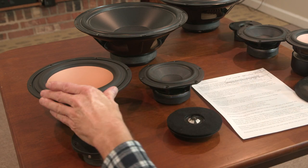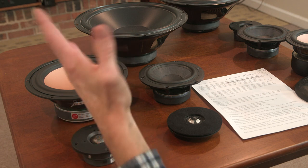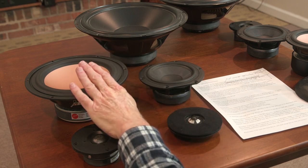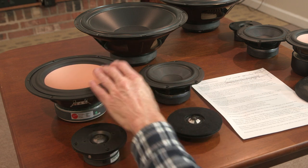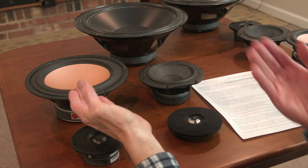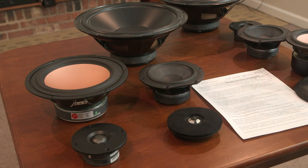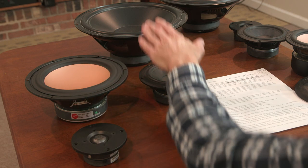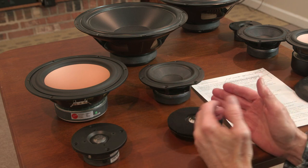Now, I have to say, listening to my 8-inch two-way system just about every day up in my office, I'm not sitting and hearing that Doppler distortion and complaining, oh, that Doppler distortion, it's so annoying. I'm not noticing the Doppler distortion. But if I put test tones in my 8-inch driver, a 1,000 cycle tone I mentioned, or 1,500, and then put a 40 cycle tone on top of that, I could probably hear that 1,000 cycle tone modulated on the 30 cycle wave, and you could probably detect that Doppler distortion easily. So the Doppler distortion is there whether your ears attend to it or not. And obviously you'll limit that. You don't eliminate Doppler distortion with any driver system, because every driver is producing a range of frequencies.